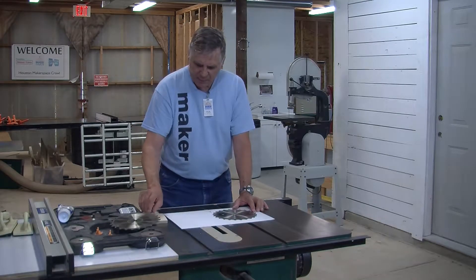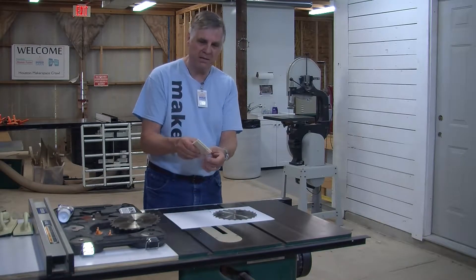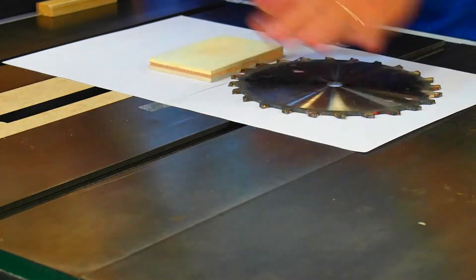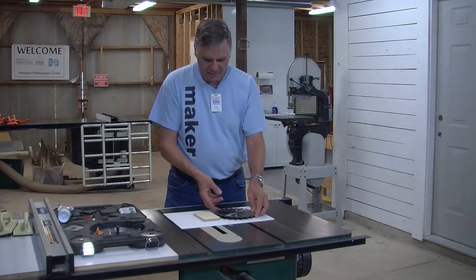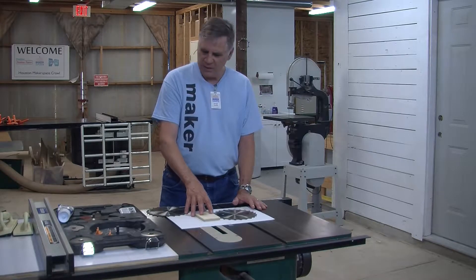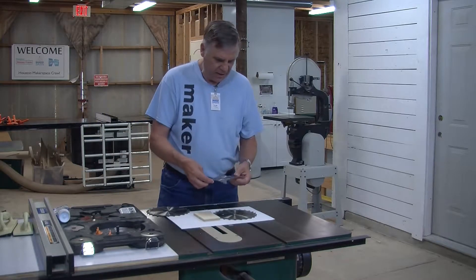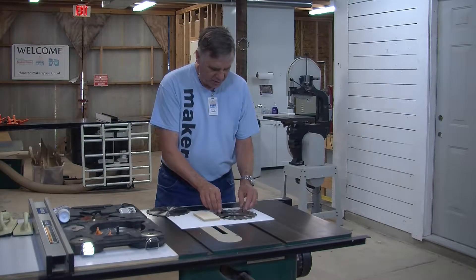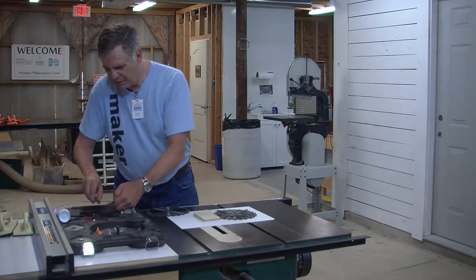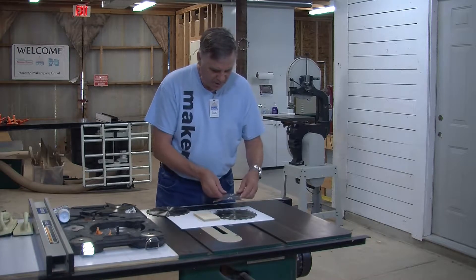What we want to do is stack up our blades to make a slot in our workpiece that will fit this panel very nicely. We've got a plate on one side, the other plate will go on the other side, and we'll put the chippers in between. I know this panel is about a half inch — not quite — so I'm going to put an eighth-inch chipper in there, and try a 3/32nds as well. For a normal piece of plywood, this should be very close.